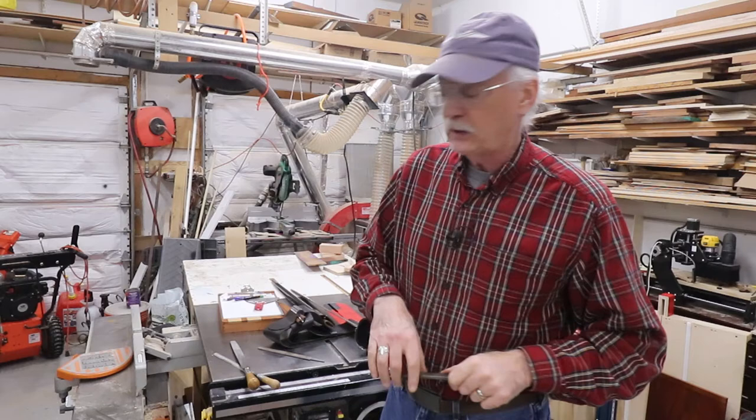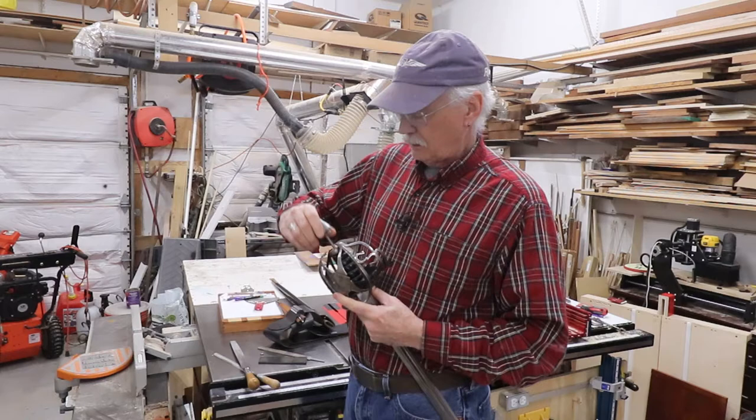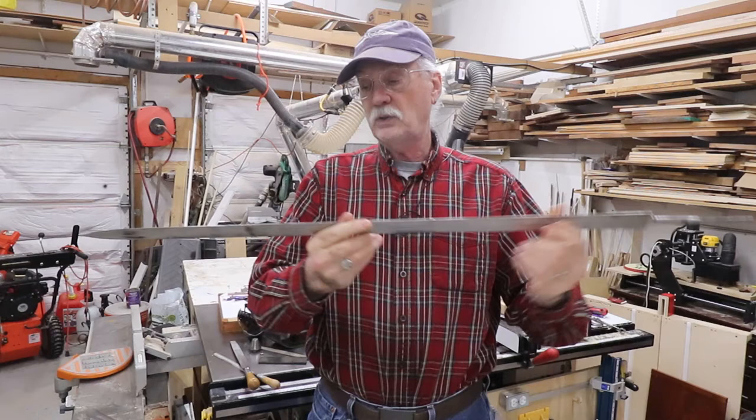These swords would not have been polished back in the period. Another nice thing about these swords is they come apart. There's a little nut on top of the pommel, which is a quarter-twenty, and then the pommel comes off. The basket and the grip come off, and now that leaves me with the sword — a nice flat surface I can put up into a wooden jig and start taking metal off of it, both sides, symmetrically. Make it thinner here and lighter here and take some of the weight off.